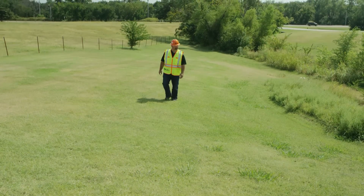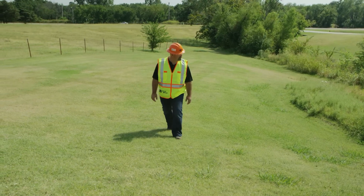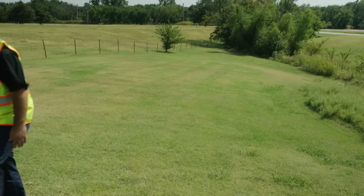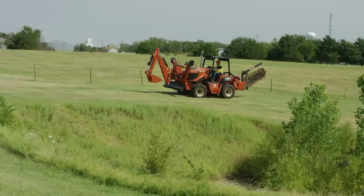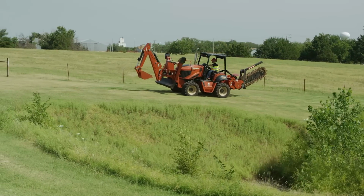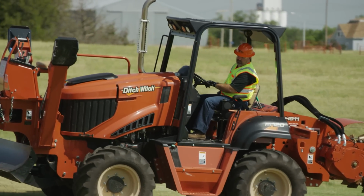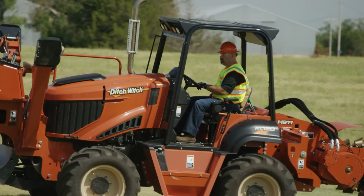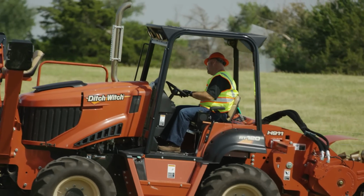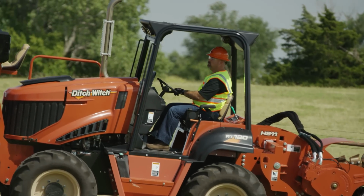Avoid operating on slopes. Perform a risk assessment on each slope to determine if factors affecting risks create an unsafe condition. Ground conditions, such as loose or wet soil, rough terrain, etc., reduce traction. Never work on an incline during rain, snow, or sleet. Saturated soil can give way and cause the machine to become unstable and tip over. Keep the heavy end of the machine facing uphill.